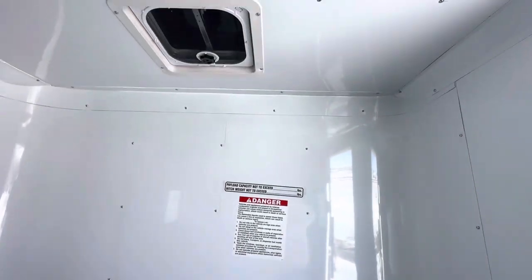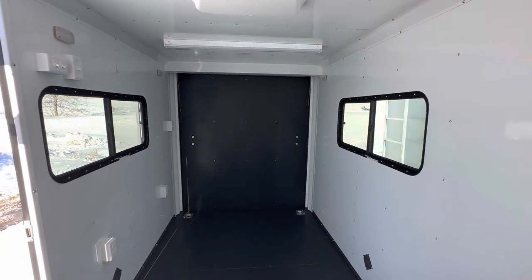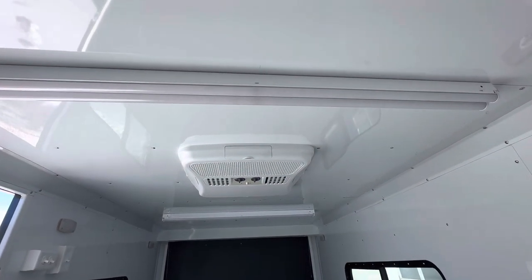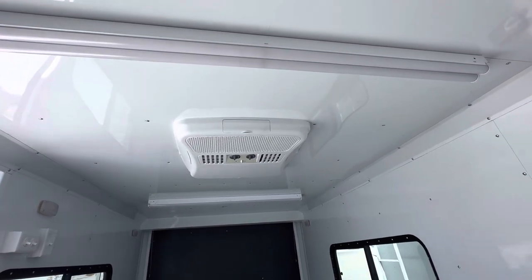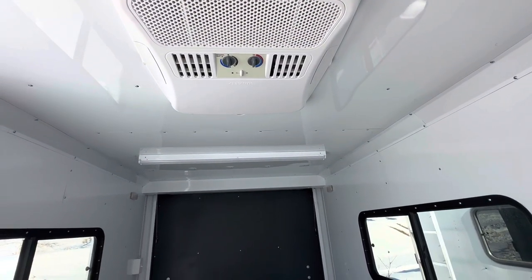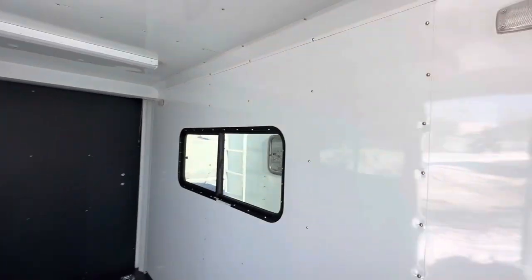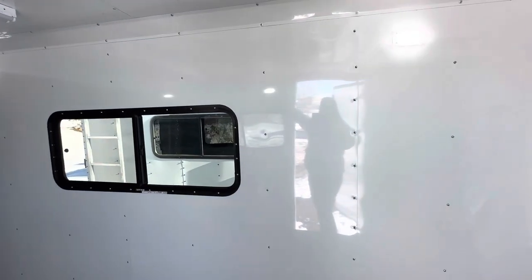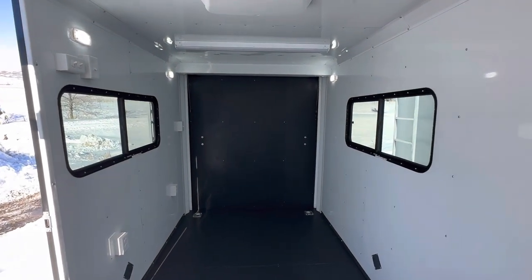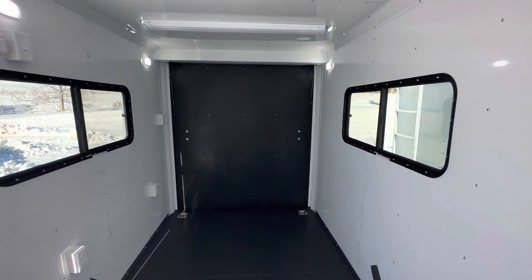There's also a breaker box, an interior outlet, and overhead roof lighting. Coming around inside: we have the white aluminum wall and ceiling liner and two 4-foot LED lights — these are 110V, so you'll need your generator for those. You also need the generator for the AC unit with heat strip and to run the battery charger and outlets. Everything else is 12 volts — the puck lights and all the exterior lights we looked at run off the battery, so you don't need the generator on just to have light inside and outside.